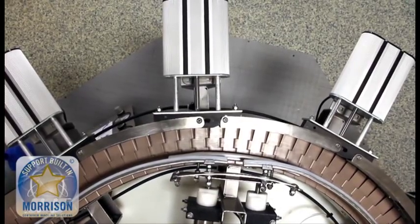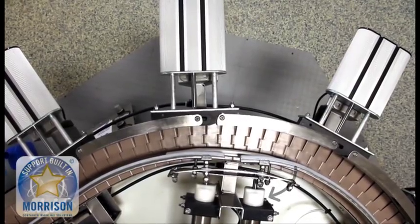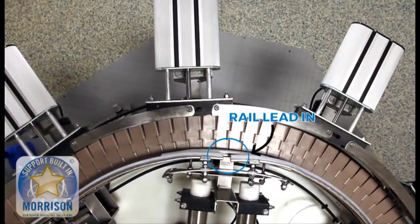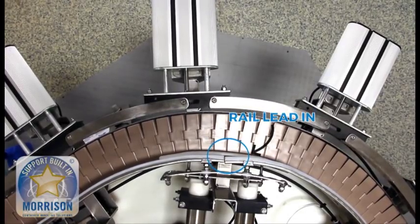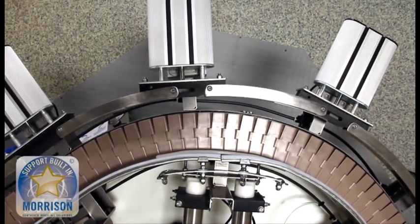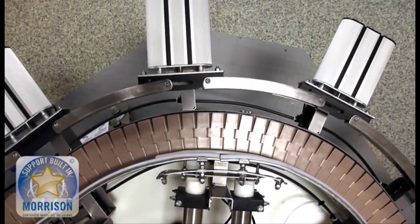The adjusters on the inner side of the conveyor are designed for containers. The secret behind the patent of these adjusters is the spring that is inside each of the cylinders. All of the springs are engineered to the same poundage levels so that when you apply air pressure to them, they will all go to a consistent position. In essence, pressure equals position.